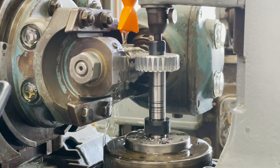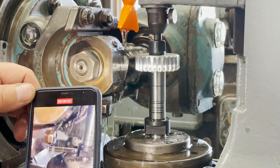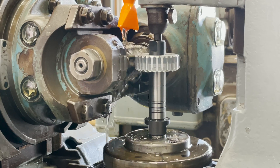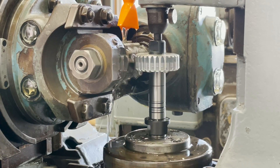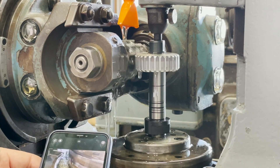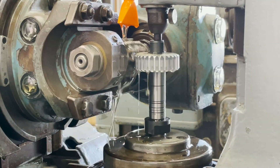Practically there's a lower limit of about 10 or 12 teeth depending on the machine, but you can cut any tooth count you want with the same hob — unlike milling a gear. Looks like this one's just about finished. We'll pull it off and check out all those same scallop marks. This is a 2-to-1 gear reduction between these two gears — a 28-tooth gear and a 14-tooth gear. The gears in mesh are set at their center distance and they'll run nicely against each other.